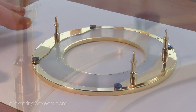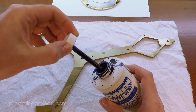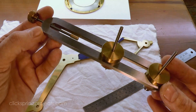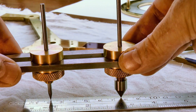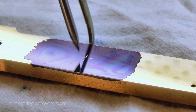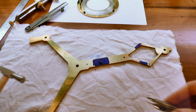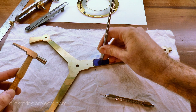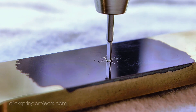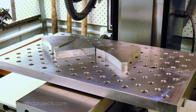And that's where I'll leave the dial assembly for now. The next step is to drill and tap the holes in the front plate to accept the pillars. Each of the holes is at a fixed radius from the center arbor pivot hole, and I'm using this depthing tool to mark out that distance. Click on the link if you'd like to see the videos showing how this tool was made. With all three hole positions marked out, each was then drilled and tapped to match the thread on the dial pillars.